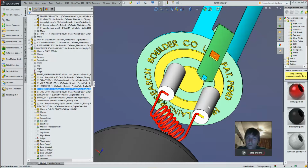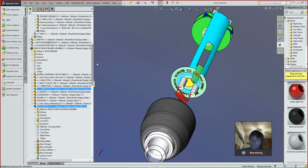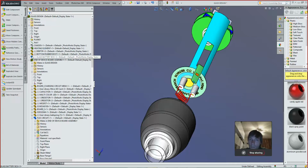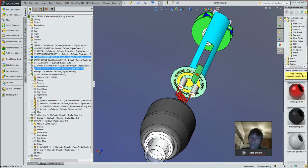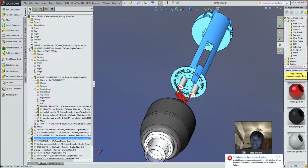So hopefully the flex circuit can handle this, and these are just going to be an aluminum contact, and we want this to be bare here. This can just be our graphics here, so when they open it up, they see the company's stuff there, because they're going to swap out this ceramic chamber. Right. If you restore the atomizer element there, that entire section is a modular element that has a thread that screws onto the chassis itself. So when that portion of the atomizer was removed, that upper area of the flex circuit would be exposed, within the inner ring of the chassis there. Which is another reason to put the print on there. A little extra advertising. Okay.